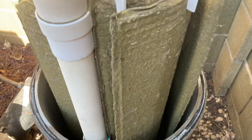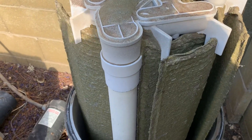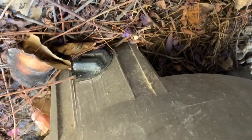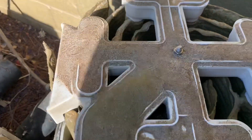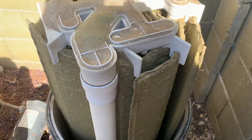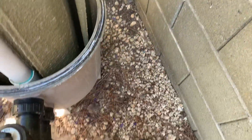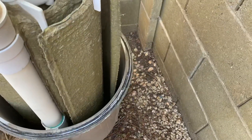Start new with new DE powder and you'll see a huge difference. There are basically three ways you can do this. The first way is the easiest but the most messy — you can just clean it right here. Most filters have a drain plug; mine is right there, that little black thing with a slot for a screwdriver. You turn it, open it up, and then you can get a garden hose or a pressure washer and just squirt it right here, let it all drain out. I was going to do that, but you can see all these needles from this tree here.